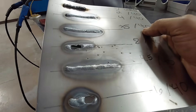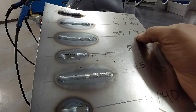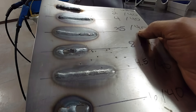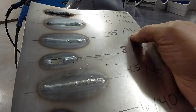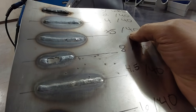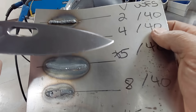It had a very good sound. What you want to listen for is a continuous buzz — they call it a bacon frying sound, just a continuous buzz. If it's popping, if it's crackling, anything like that, your weld setting is off. Let's go back to our baseline and recap.